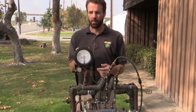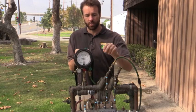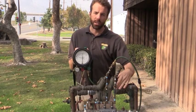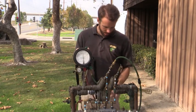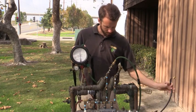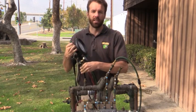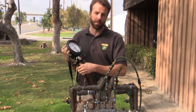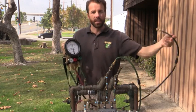Now that I've determined that my relief valve opening point is higher than 2 psi differential, I'm going to go ahead and check my number 2 check valve to make sure that it's holding tight. So I take my bypass hose and connect to the bypass section on my differential pressure gauge, then connect this to the number 4.